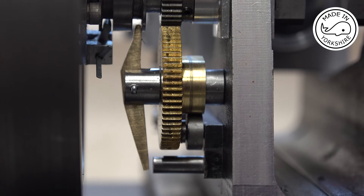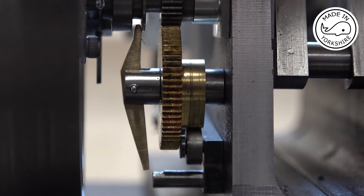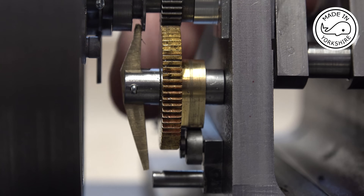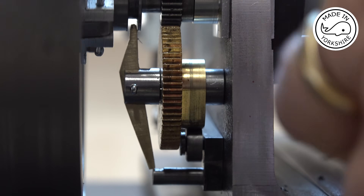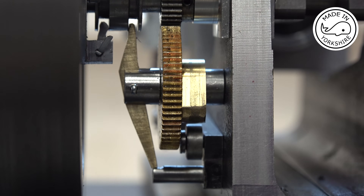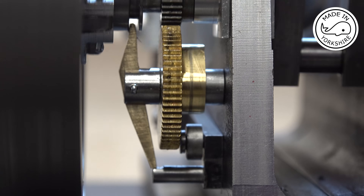This is a view of the cam gear engaging with the rocker arm. You can see that's where the governor lever — the catch lever — keeps the exhaust valve open. If I open up the governor, the catch lever goes like that and it'll hold it open once it gets up to a particular speed, and when it slows down it'll release.